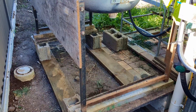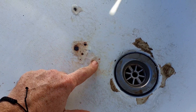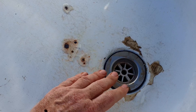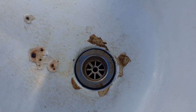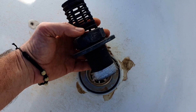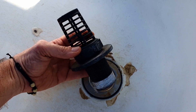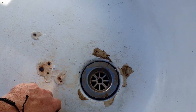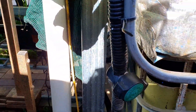I've had to raise it up quite a bit so the drain will fall down into the sump. I've had to cover up a couple of breaches in the paintwork with some fish-friendly aquarium-grade silicone just so it doesn't rust out. The plug assembly is going to cause a few issues, so I'm going to remove that and replace it with a bulkhead fitting - a 40mm or inch-and-a-half - with a foot valve screen over the top. That will stop the clay balls from blocking up the pipework running back into the sump, and that pipework will run straight across into our sump tank underneath this grow bed.